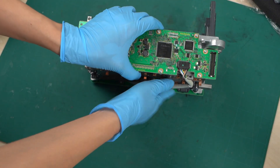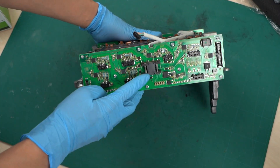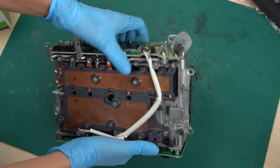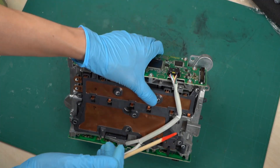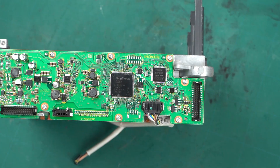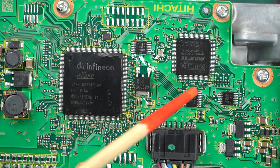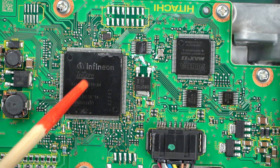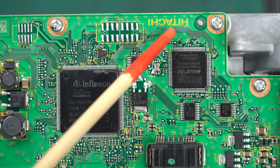Regarding the main part of the inverter, a control board is on one side and on the other side there's a gate driver board. Two boards are used. The main control board sends signals to the gate driver board through a flexible circuit, which connects here on the gate driver board and here on the main control board. These are the main parts of the control board — two ICs are used: an Infineon microcontroller and an Altera FPGA. I assume the control operation is mainly performed by the Infineon microcontroller and the auxiliary operation by the FPGA. Hitachi logos here — classy.